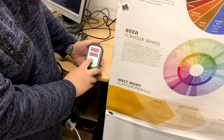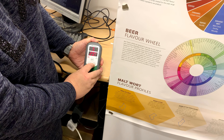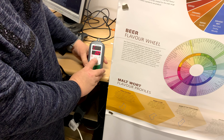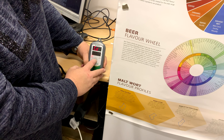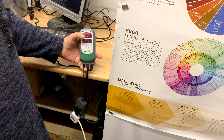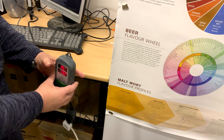This is where I probably should read the manual, and I will — I'll save you all having to do that and let you know any hints or tricks afterwards. 25°C is flashing. You'll notice it does it in decimals as well — it's not whole digits like some of the cheaper STCs. So we want to set it for 20 degrees. It's currently telling me the temperature is 17.9°C, the set temperature is 20, and it is heating at the moment. So the tube heater is on and it's going to bring it back up to 20°C and then shut off.